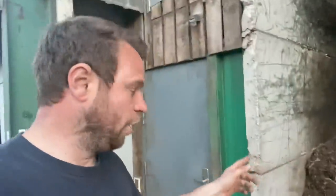There's the wood chip that we saw going in. This is a drying floor. So the drying floor works by blowing air down what's called an air tunnel, which is this. We've got hot air now flying down this tunnel. And then underneath it's got bolt logs in, because we sometimes dry logs. I'll go around and show you the other side, but basically we blow hot air down that tunnel.